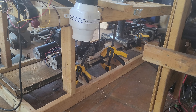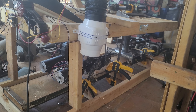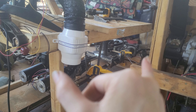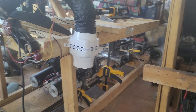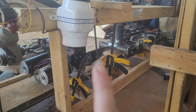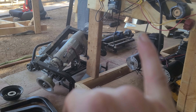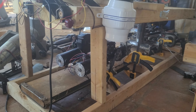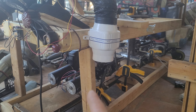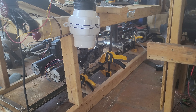You can see that the motors have been raised a pretty good amount, so the distance at the front is significantly more than the distance at the back. So we've got to chop the connecting rods right there underneath, and that one over there, get those measured to whatever size they need to be, chop them, and then lower this until it's completely level and re-weld those at the height they need to be.